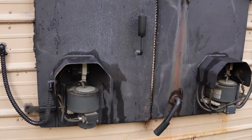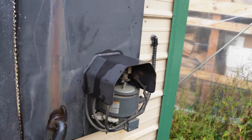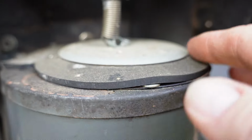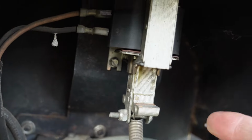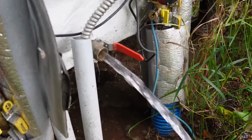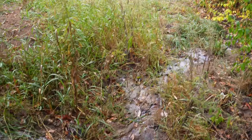All right, so I don't have all day to wait on the rain. Got a little break in it. I went ahead and popped all the covers off of the fans and these dampers, and the old dampers look just fine. A little bit of crud in there, but I've had issues with the spring coming loose before, like that right there. It kind of slides out every now and then, but the flapper itself looks great on all of them. And I also went ahead and popped that valve open to let her start draining out. For about the first 3 seconds, there was some kind of cruddy looking stuff, but now all looks clear. Probably down to the last quarter of it. This flapper valve way up in here looks pretty good too.